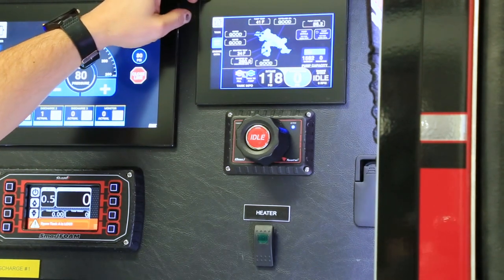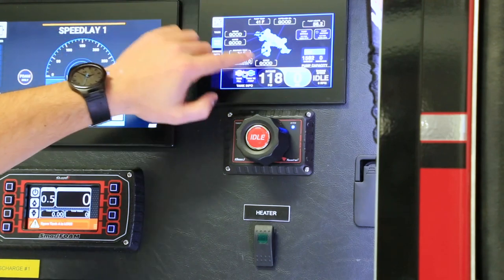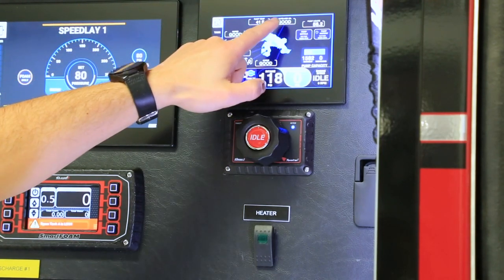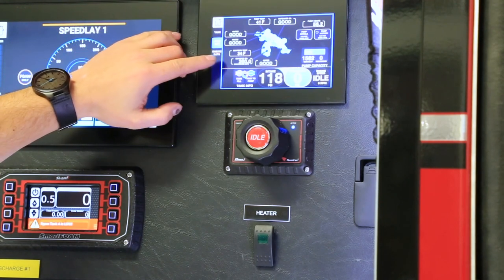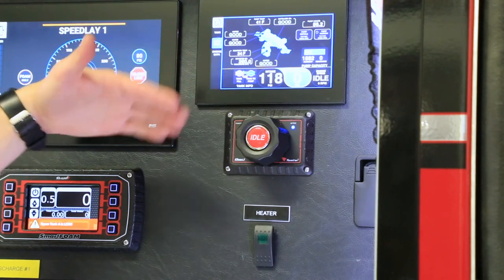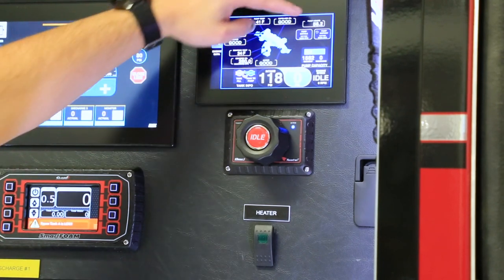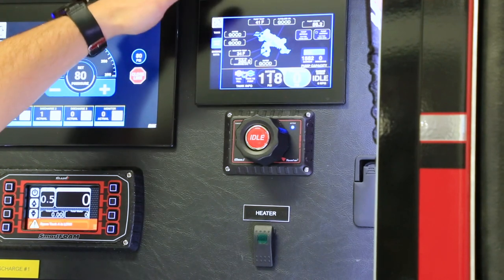The following screen is pump info. On this truck it's got three anodes — it's telling us anodes one, two, and three are all good. It's telling us our auto lube oil is good, gearbox temperature is 34, gearbox oil has 260 hours remaining — that's a countdown when the pump is running. Over here we have our pump hours showing how many pump hours we currently have on the truck, and then we have our pump temperature.